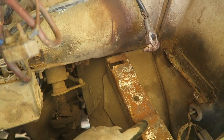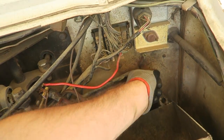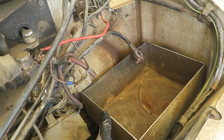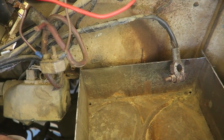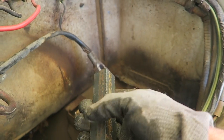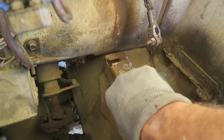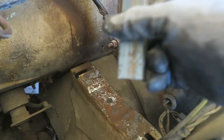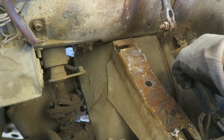After doing some cutting and grinding, it's all smoothed out in there for the most part. Most of the old metal has been removed and the battery box has been cut - it actually fits in there really nice. It's a pretty tight fit but it fits good. I'm trying to figure out a way I can mount it because I want it to be removable in case I need to get to anything below it or to the side. So what I think I'm going to do - here is a piece of angled iron - I'm going to go ahead and cut it in half, make a bracket for this side to sit right there and then one on the other side. Shoot a hole in both of these and put a hole in the bottom of the battery box, run a carriage bolt through so it won't hit the bottom of the battery and break it open. Then it should be good to go because it'll be removable.